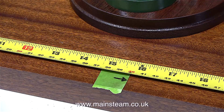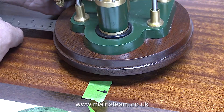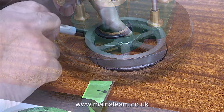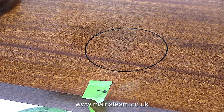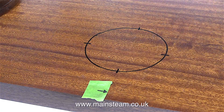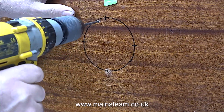I need to make sure that the steam engine sits right in the middle of the board. The board measures 80 centimetres in length, so rather than draw a felt tip pen line on the wood I put the line on a piece of masking tape and stick that 40 centimetres from one end. I place a small cast iron flywheel on the wood and measure the distance between the engine's base and the flywheel all the way around, then lift the engine's base off and draw around it. I mark the positions with a felt tip pen and then using a 3/16th of an inch diameter twist drill in my DeWalt drill I drill through the baseboard on the marks.